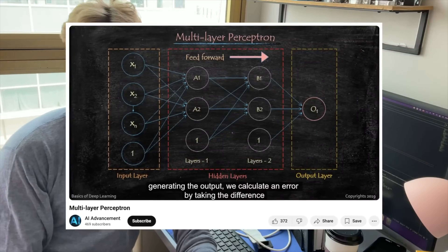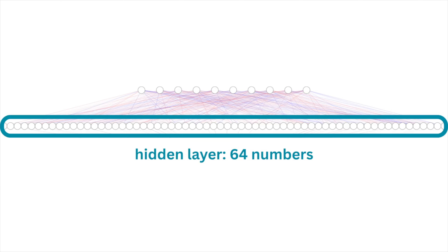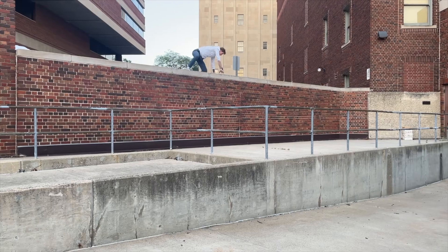To translate these 10 sensor signals into a binary firing signal, I use machine learning, which is a great tool for this type of perception. During my PhD, I used a lot of these algorithms to deal with robotic tactile perception, so it's not a dissimilar problem. But I do want my products to be relatively inexpensive, so the machine learning models can't have a lot of weights. They need to run on a relatively rudimentary microcontroller. So I paired this sensor with some data collection hardware that I created to label in real time gestures that I'm making with my hand, then used that data to train a machine learning model which will hopefully generalize to any situation in which I'm wearing this sensor.